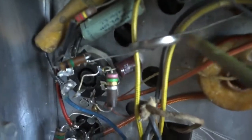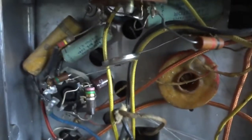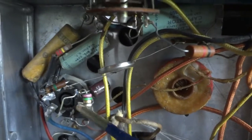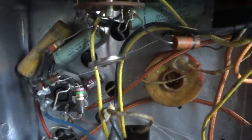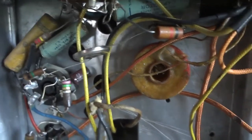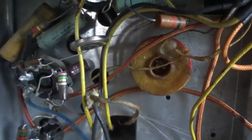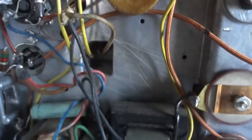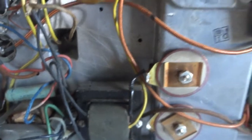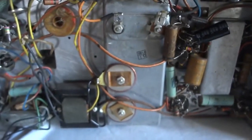Here's another interesting thing — I put a lithium coin cell there. This radio needs a bias battery for the PA tube, the audio output tube. The original one was obviously shot, and I think the original was about four or five volts. This one is 3.3V, but it still works pretty well, so I decided to leave it like that.